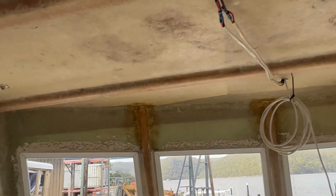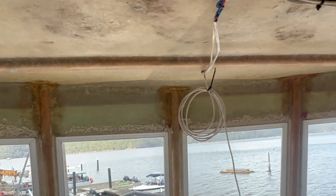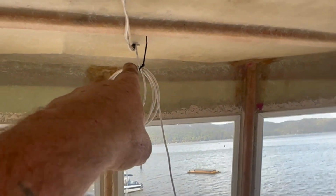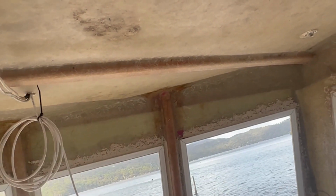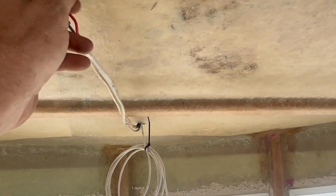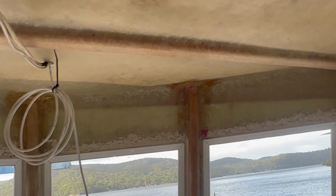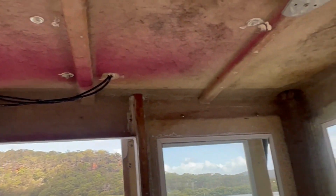And we'll line the roof, so I'll put a timber beam, probably somewhere here, line the roof, leave an inspection hatch probably over here, or one down the middle of the roof, so at least we can get to any of the wiring if we need to. So I'm going to change a couple of things there. I'll probably just solder all them up so they're one joint, so there's no bad joins, can never happen. And then really, shouldn't need to put any more wires to the roof.